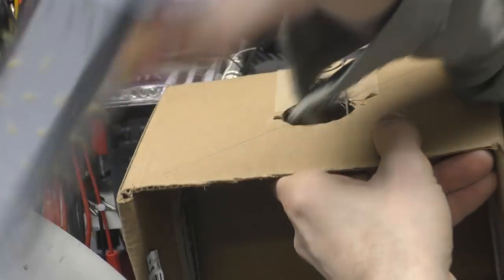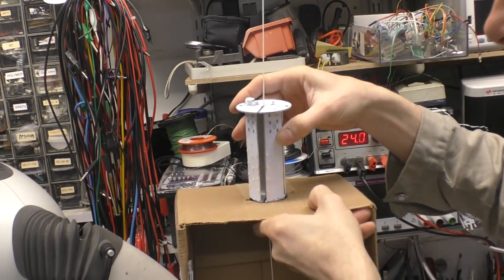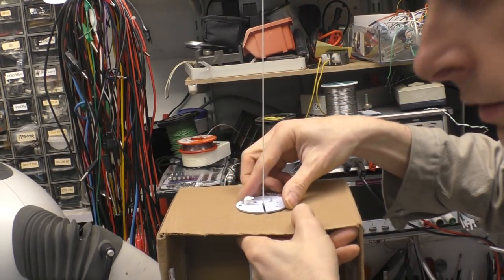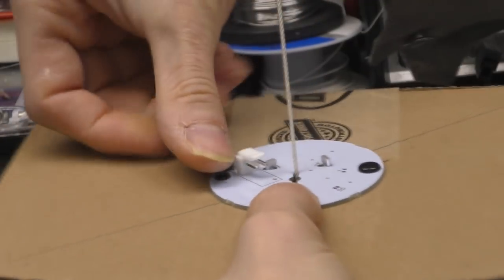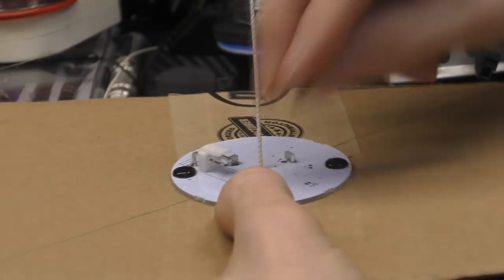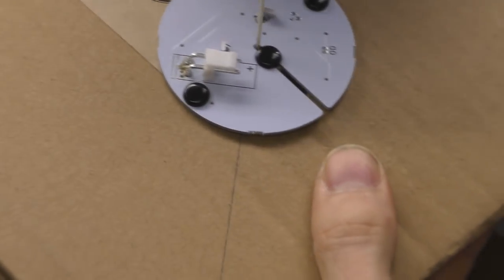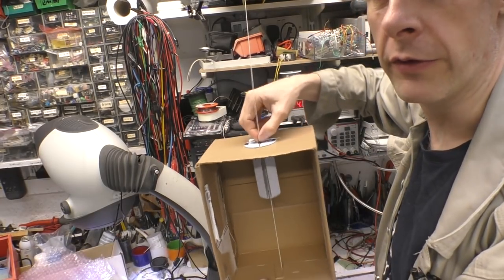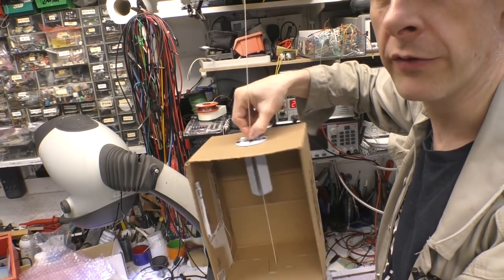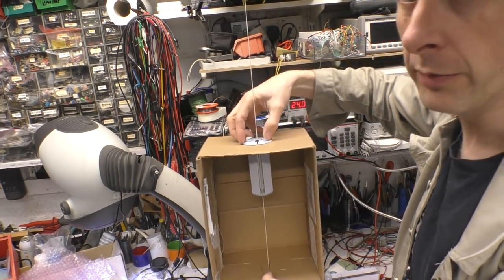The LED assembly has these slots at each end, so this gets slotted onto the cable, and dropped down into the cube. Then we just use 3 plastic snap rivets, 2 to fix the PCB into the cube, then a third one here which locks the position of the drop cable, so this now can't move. We've just got a single hole for the drop cable to go through. So this now stays vertical because we've located the drop cable at the top, so this all stays nicely together, so the PCB is actually acting as part of the mechanical assembly, and that worked really nicely.